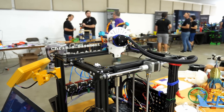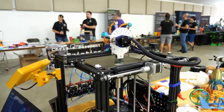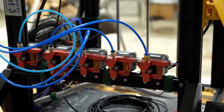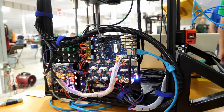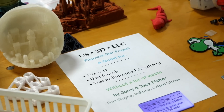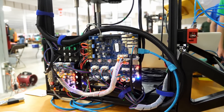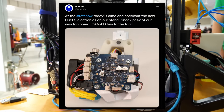Jerry made his current design for the typical Creality-style motion system with 20-20 extrusions and three rollers, and has it installed on his Ender 5. The rotation of the tool is performed using a geared stepper motor with plenty of holding torque at the parking position, and homing is done via a hall sensor. Since every tool uses its own extruder and heater, they use a Duet board with an extension board for all the stepper motor and MOSFET outputs. All the necessary wires lead to a huge umbilical which isn't super practical. Jerry told me they've been talking to Duet about making a CAN bus extension board so only power and data need to be transferred to the tool head — a neat solution we're seeing more and more on other machines.